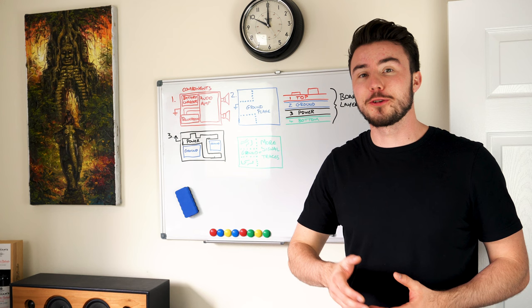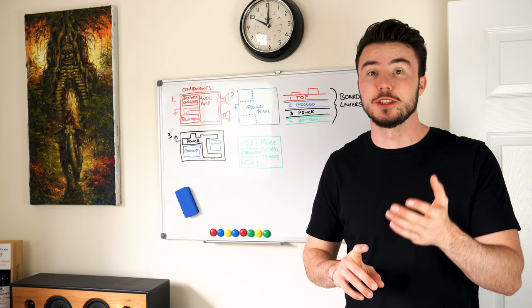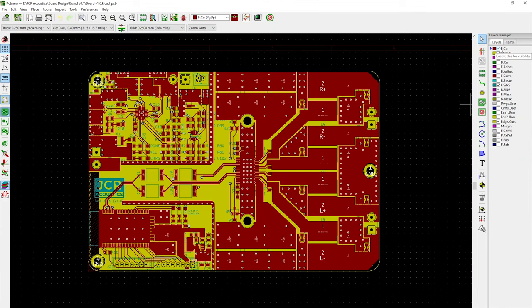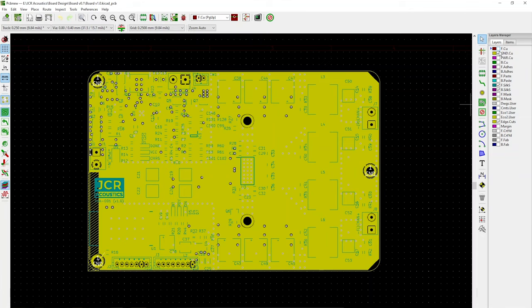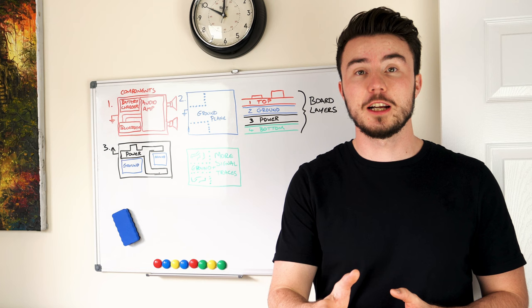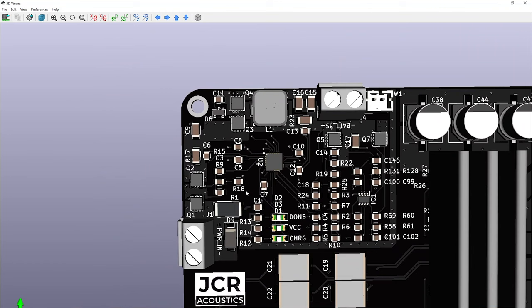Correctly designing your PCB layout is critical to ensuring all the various components function as they should. Especially where audio is concerned, avoiding noise is vital. A solid ground plane is key to a good design. On a two-layer board, you should have a solid ground plane on the bottom and avoid placing any traces on that layer that would break it up. Because my board has a battery charging IC with sensitive signal traces, inductors, and high-speed switching, a four-layer board was required. My initial prototype lacked this, and as a result critical components such as the current sensing resistors were too far from the IC.